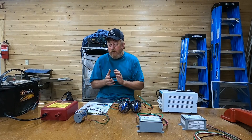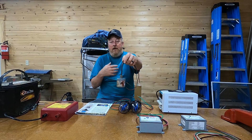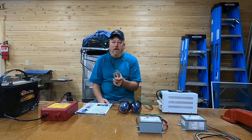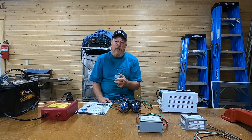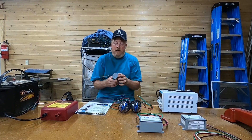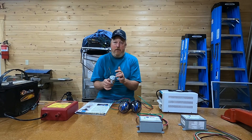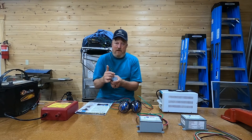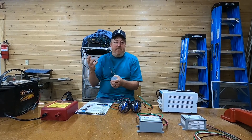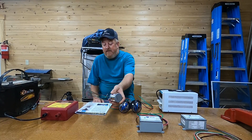So keeping that in mind, the snake oil in the room — and maybe snake oil is a harsh word, but I invite anybody from Delta to come sit down with me on video and explain to me why I'm wrong. This here, when I started in the solar industry, I was buying these by the cases. I was putting these everywhere, fat and happy that I was protecting my customers' systems. Then I got a call one day from a customer who had a lightning strike nearby and this had blown open and sand had fallen out. That's when we started looking at it. All this is, is a spark gap. There are literally three metal prongs in a ceramic disc encased in sand. The spacing on those gaps is going to require about 8,000 to 10,000 volts to jump the gap. So if you've got a 7,000–8,000 volt surge on one leg, it's not going anywhere because it doesn't jump the gap.